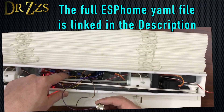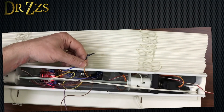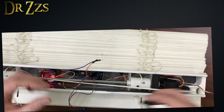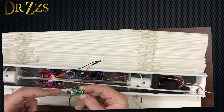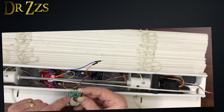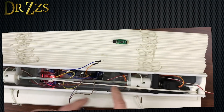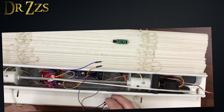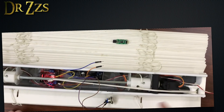You'll notice here that this blue light is not on. For demo purposes, I'm going to disconnect these. When I double click this, you will not be able to miss the blue light come on. Now it will send the signal, turn the servo, and then in a couple seconds it goes back off. Beautiful. That essentially does what the filter was intended to do — monitor the signal line, and when there was no signal for the servo to make an adjustment, switch off the power to the servo. Now I've set it so that power to the servo only comes on when I tell the servo to move — either via the button, through an automation, or through the icon in the home system. After the servo has received the signal and moved, power is disconnected. There is absolutely no way this servo is ever going to chirp again. That's a victory.